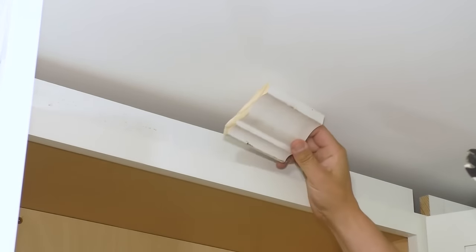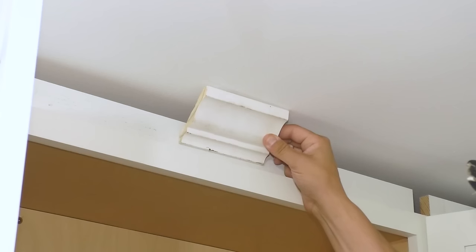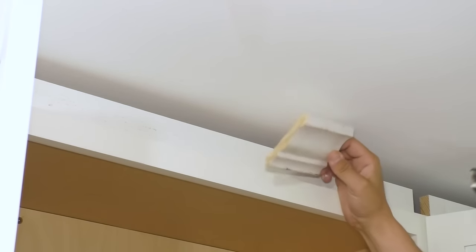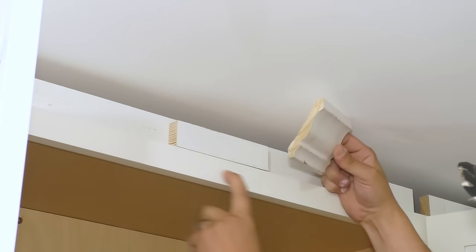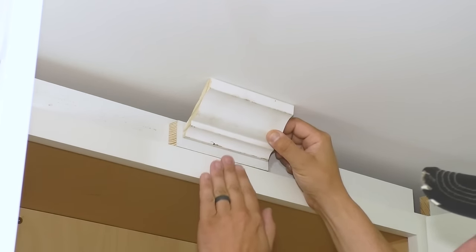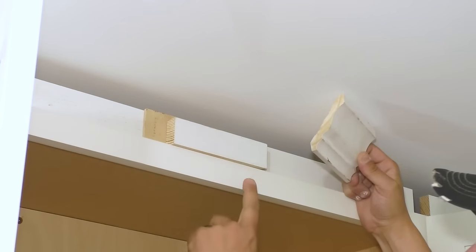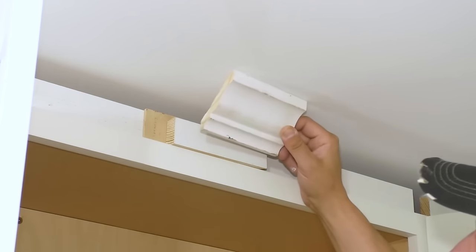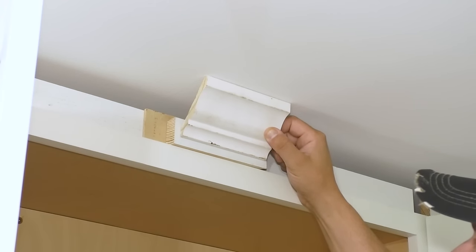So here's the plan. My crown molding is going to go up to the ceiling, but I have nothing to nail to here, or I could set it back like this. I have a couple options. Take pieces that are the same color as the cabinets — they're actually cabinet fillers — and do this, where this is nice and even. Or, what I'm going to do: put a filler piece in here, and then this piece in here, and put my crown just like this. That will give it a little added detail right here.